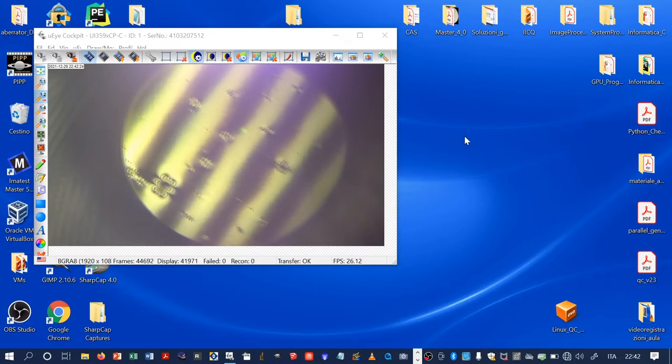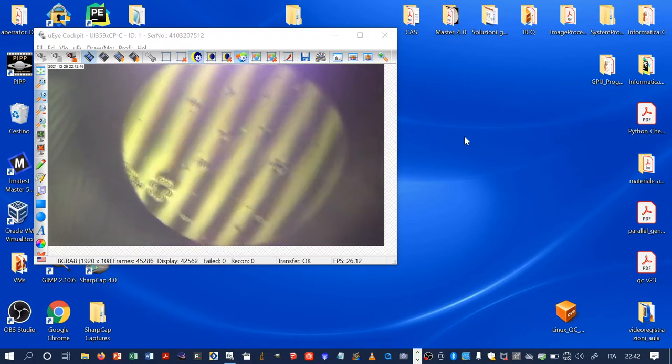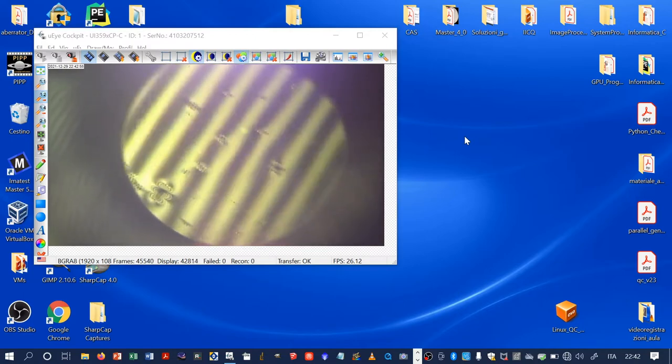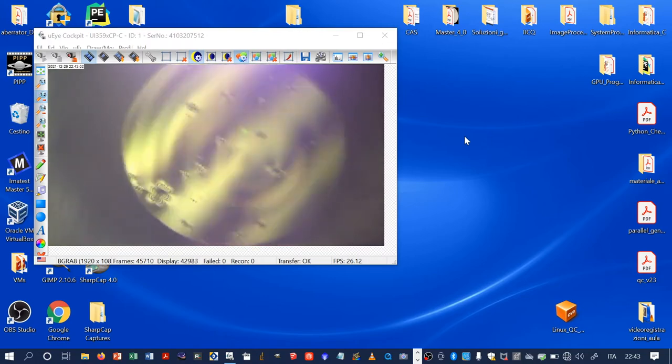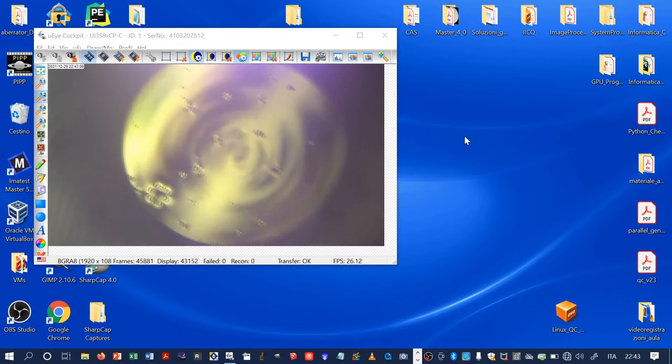Now we will move to 2.5 lines in the field in order to increase the power. Please note that we are in autocollimation, and so the standard effect is doubled. Okay, so we can move. If you see, now we are going in intrafocal. Okay, now we are seeing more lines. And now I will go toward the focus in order to arrive to 2.5 lines in the field. Okay, approximately we are here.